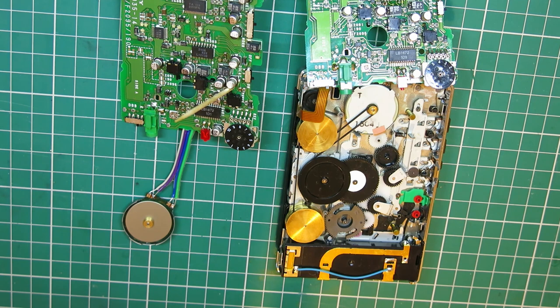That's running at 1.2 volts, it's drawing 40 milliamps, it's a consistent speed, it's not growling at me, and I've been running it for a while on and off, with a voltage anywhere between 1 and 1.5 volts. I can actually get this down, that's 1.1 volts, that's 1 volt. At 0.9, we start to drop the speed, but the speed is consistent. So I think I've at least sorted out the physical clash that was happening there.